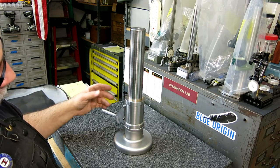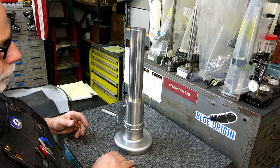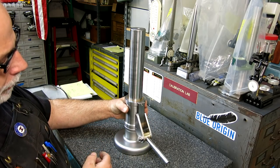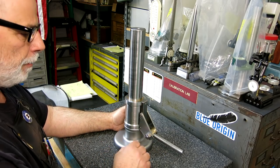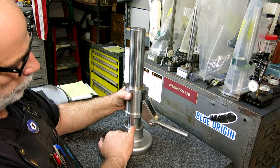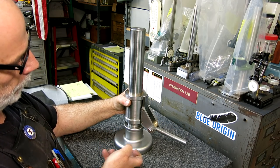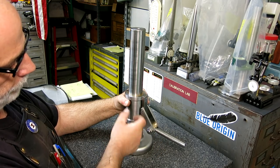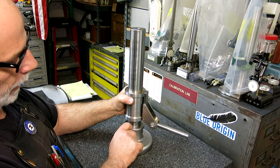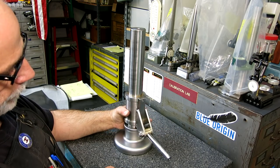So the trick is now to get this perfectly perpendicular to the base, right? So the way we're going to do that is we're going to sweep around. But thinking about it and then talking to my buddy Robin, we can't use this surface as a reference because what we care about is the surface here. And now this can rotate about this cylinder, but we don't want it to track on this lower surface. So now the question is, how do you hold that in the right place and sweep around,